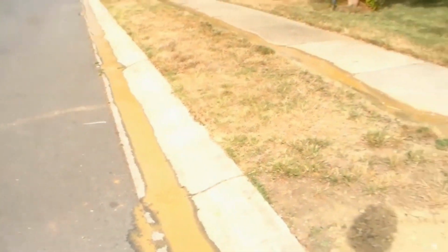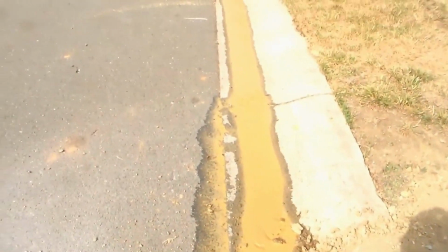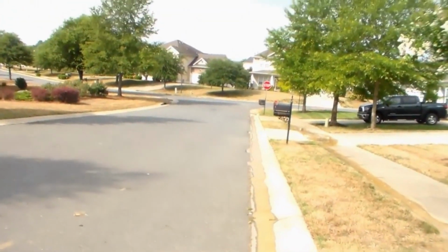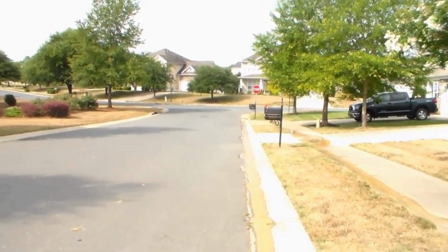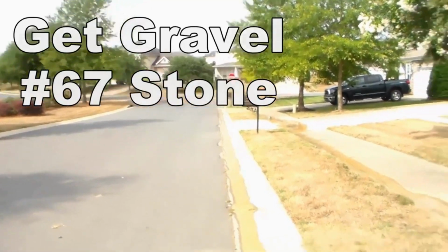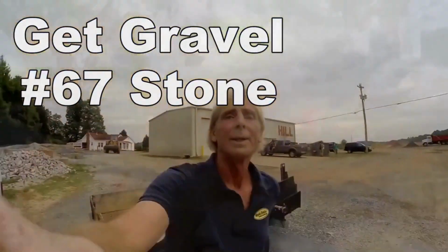You know, downspout drains, yard drains, all those things, this is where they're supposed to come. They're supposed to come out here to the street. That's why there's a curb. That's why there's storm drains at the end of your street. A little 10-foot piece of pipe sticking off of the downspout is not how you do this.